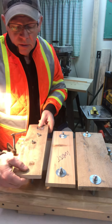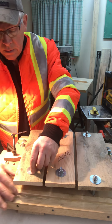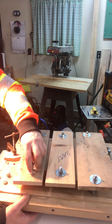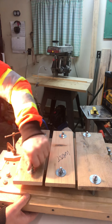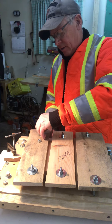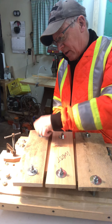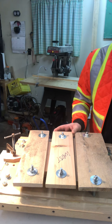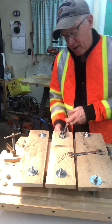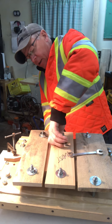I'm just going to make sure I'm fitted. Make sure that I don't pinch down where I don't want to. Now I have some very strange looking pieces here. I purposely got old, old maple boards that have a cup in them so that when I torsion down on the center bolt, I get pressure on the outside edges. That's why they're rough — I never planed them or anything. It was one of those things where I was working to make sure I get full pressure wherever I need to.